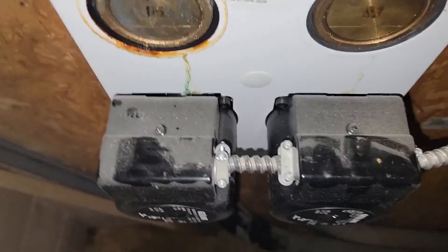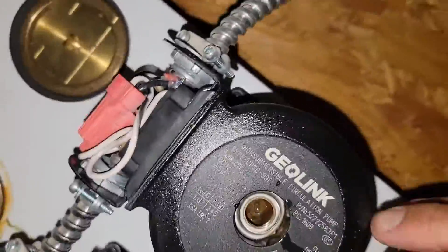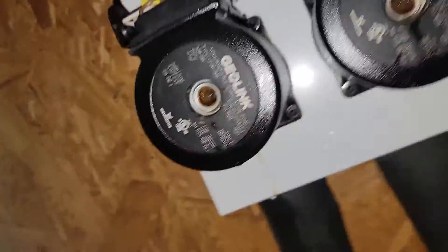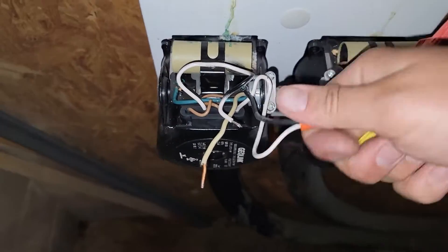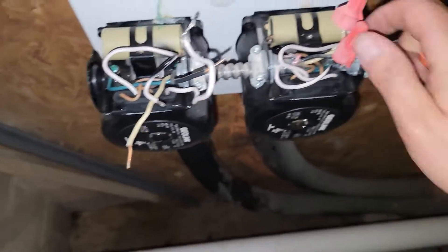Power's off. Make sure you know exactly what size the pump is — how do you know that? Take it and turn it sideways. It says right here: UP2699. Both of these pumps are the exact same, and the voltage is 230 volts. So we've got two power wires and a ground. Make sure that you cut the power to the unit, which means you don't have any power to the pumps.